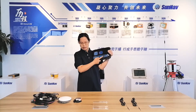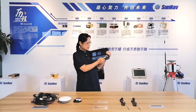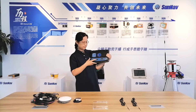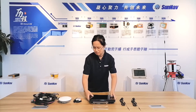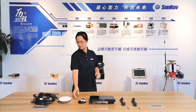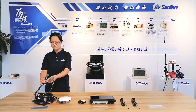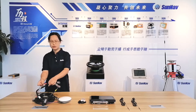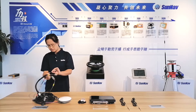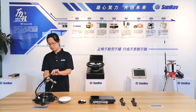Part 1 is for the main cable. Part 2 is for the handle remote. And these parts are for the GNSS antennas — this is our GNSS antenna. This is our handle remote; we can operate easily with it. Now let's look at the main cable. You can see there are several colored cables on it: the red one is for the power, the yellow one is for the solenoid valve, the blue one is for the camera, and the green one is the RS-232 port.